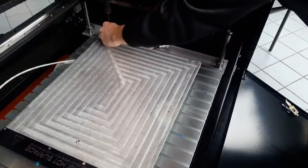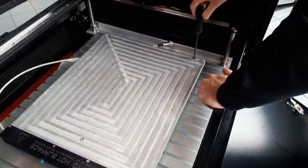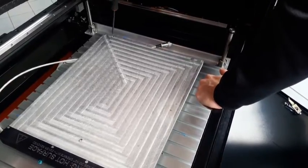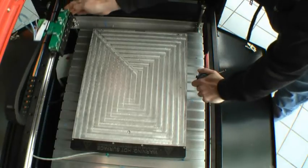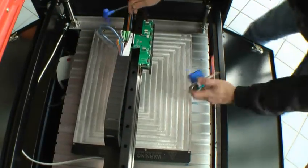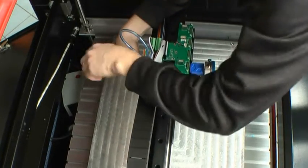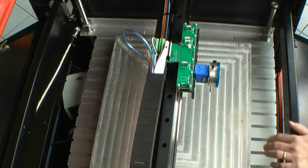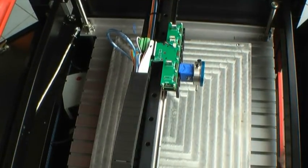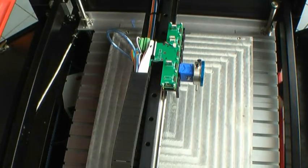These two on this side are adjustment standoffs. I'm going to make them barely snug because we want these to be able to rotate in their hole — just snug it and turn it back just a little bit to loosen it. Now I'm going to install our dial indicator. If you're using a printed block, don't put too much torque on the screws — just enough to make sure it's sturdy. I'm going to manually raise the bed by pulling on the belt until it makes contact with the indicator.